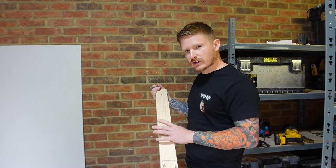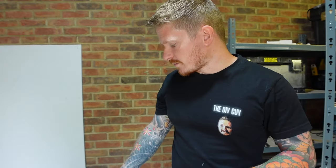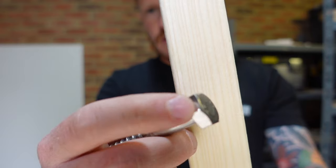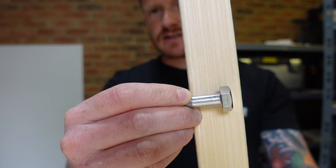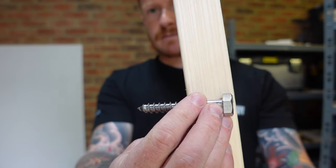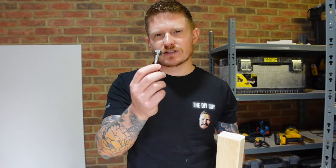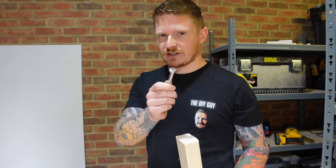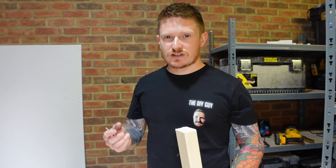With your end holes, don't go too close to the edge because you don't want to risk splitting the wood. Our aim is to use 70mm coach bolts on this 36mm CLS. We want to bury the head of the coach bolt into the timber enough so the shaft sits within the wood and the rest of the bolt travels through into the brickwork. If you're using thicker pieces of wood, adjust the coach bolt length accordingly. This method gives the most solid fixing — you can use a wall plug and screw, but it won't give you such a sturdy result, especially on railway sleepers, fence posts, or gate posts.